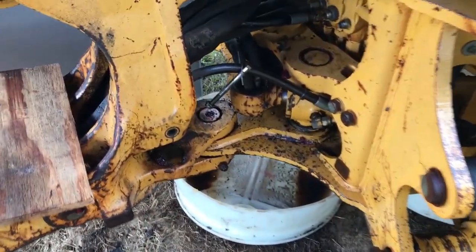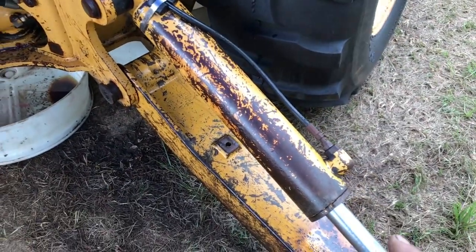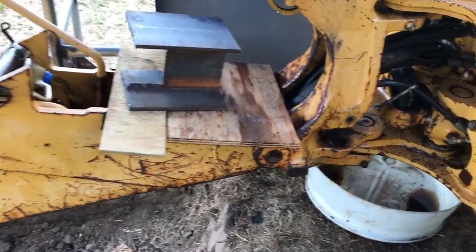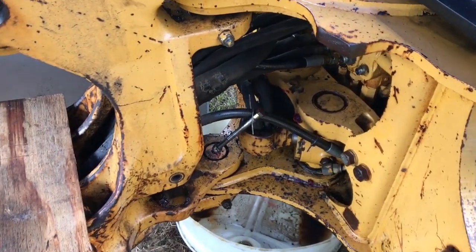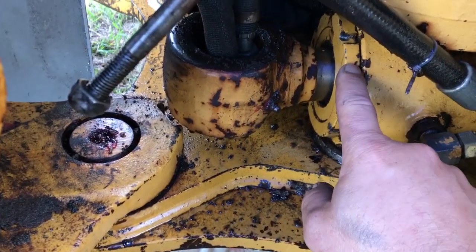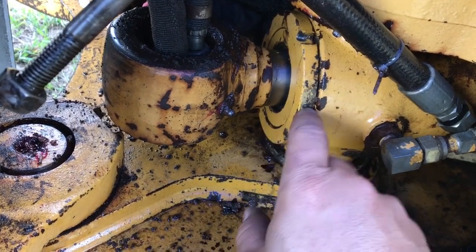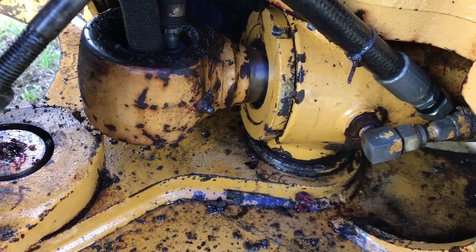What I'm going to do today, I'm going to take the other swing and this stabilizer out, clean them and have them ready till when I get the rod and the kit for the other one. Once you have it out and clean, it won't take but 20 minutes to put back together. The hardest part is to take this nut, push the gland in, take the ring and clean, sand it clean all the rust if there is any inside this, so everything will come out easy.